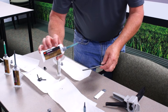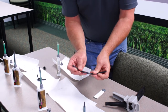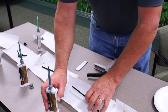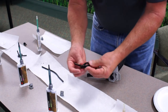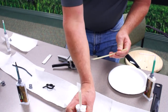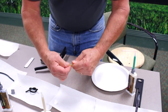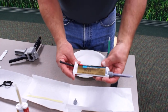Next we have the DP-420+. This is medium flexible — not rigid, not super flexible, but still flexible enough where you can manipulate it very readily. Moving on, the DP-604-NS Black. These particular products are used a lot for filling concrete cracks — in the gray version, 601. It bonds very quickly. Here is the non-3M product from Parsons Adhesives — it's the Parchite 7300 Methacrylate. Very much a structural bond, very semi-rigid if not rigid, and high capacity for durability.